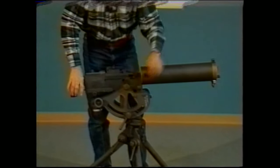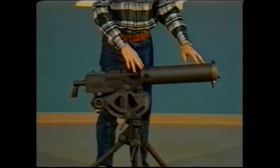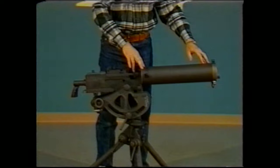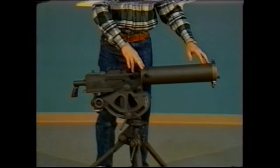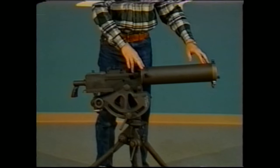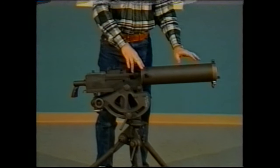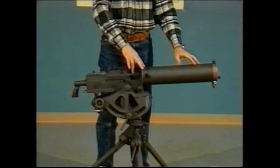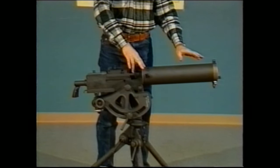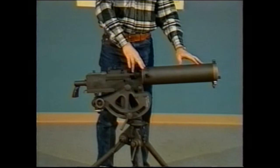The reason is because this gun works well because of the evaporative cooling that takes place when the gun actually boils the water. It's a phase change heat transfer process. It's very efficient. Anything that you do to raise the temperature at which the fluid within the jacket boils will decrease the efficiency with which it may operate. So you do want to have some antifreeze to keep from rusting. You don't want to have too much to prevent the fluid from boiling.